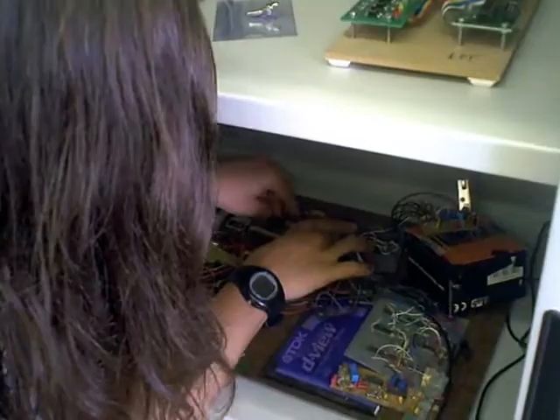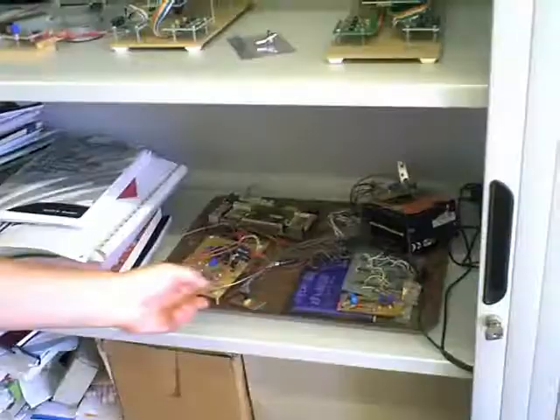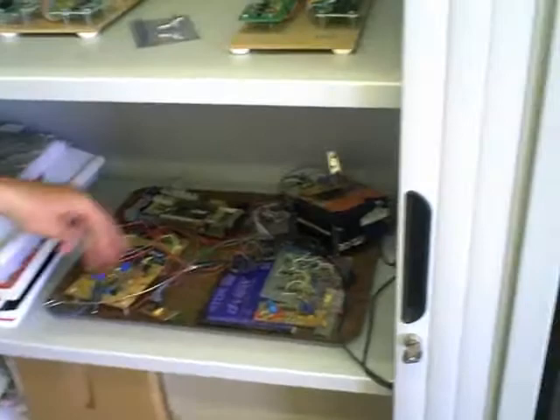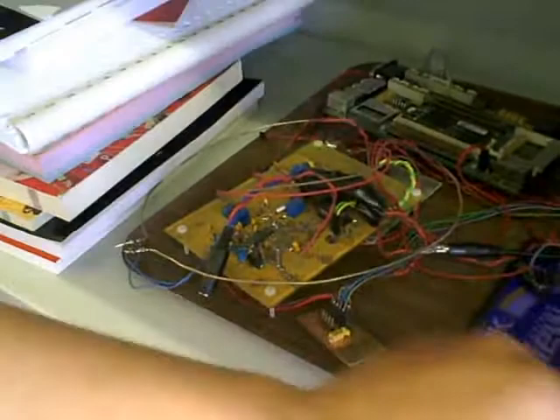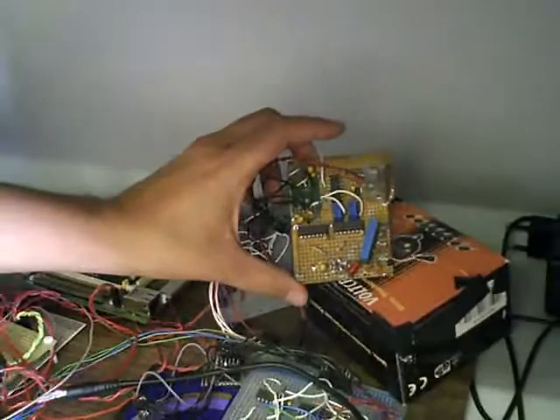You can think of this development kit as the nervous system of the platform. What we did was build our own analog front end — at the time this was the tag receiver, and this was the tag transmitter. This piece of green protoboard was an RFID reader on a chip, which is what we were using for communicating with tags. A little later addition was a Bluetooth module.